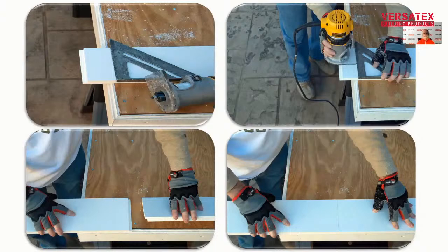We recommend that you consider using a shiplap joint. Just take a rabbeting bit on a router, square, keep the router from running around, and make a shiplap joint. The benefit is that if you do get a little bit of movement, you keep material between away from the substrate. It's an easy joint to work. Plug the router into a 3-way or get a battery powered one. It doesn't take the time you might think.